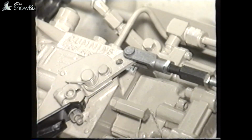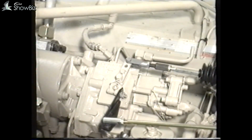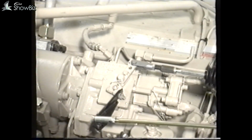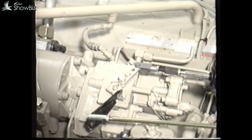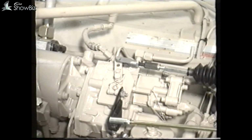It should be noted on conventional engines you would normally adjust this screw to alter the idling speed. But on the Cummins engine, this controls the throttle leakage fuel flow and must not be adjusted. Whilst in this area of the fuel pump, check that the fuel pump lever moves to the full throttle position correctly. If this is in order, it should knuckle like this, as contact is made with the maximum stop on the fuel pump. The lever, when the throttle is released, should contact the throttle leakage stop.